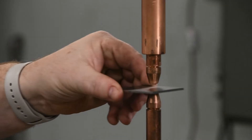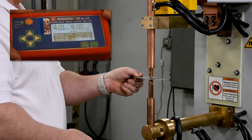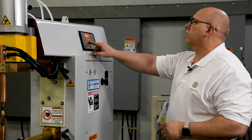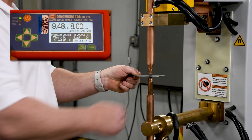Place the controller in weld mode and ensure water is circulating. Place coupons or part between the electrodes. Where part geometry allows, there should be a quarter-inch gap between the upper electrode and the material to reduce pinch point risk. Initiate the machine and make the first weld. Observe the current reading on the weld scope. If the current is below the recommended value, increase the current in amps or percent until an appropriate value is reached. If the recommended current value cannot be obtained, it may be necessary to increase the tap setting on the welding transformer. Increase one tap position at a time and then re-weld.